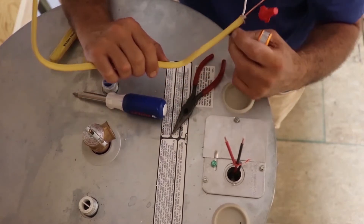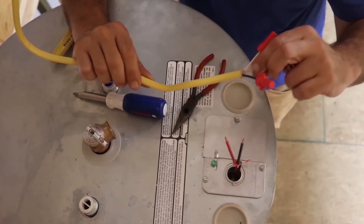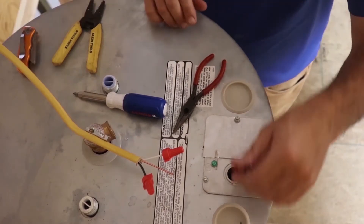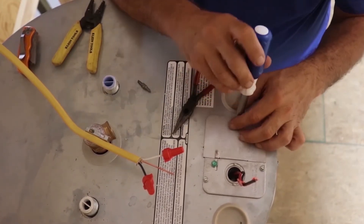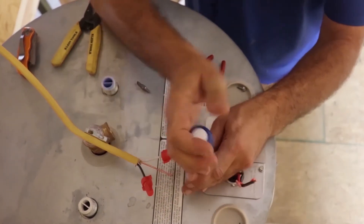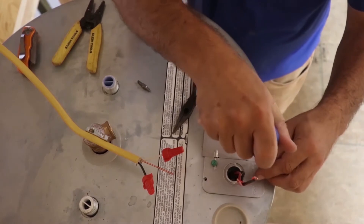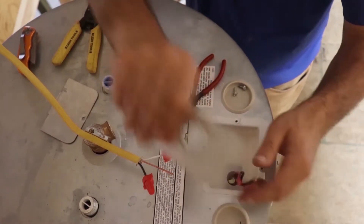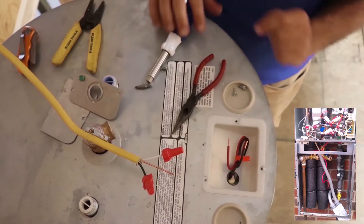When you're cutting this plastic outer housing off, be really careful that you don't nick the white or black coating on the inside wires. If you cut it straight down the middle, you're going to hit that copper wire, and you can cut that up as much as you want because that's just your earth ground. Get your screwdriver — it's nice to have one of these six-in-one screwdrivers. Go ahead and run this stuff out and take the plate off. You're going to want to fold your wires down in there nice and neat.